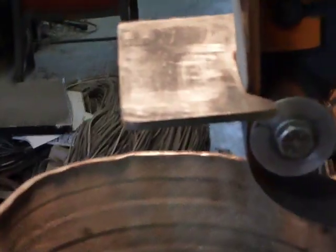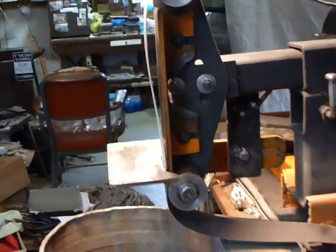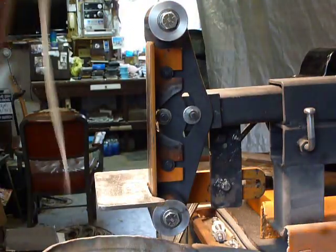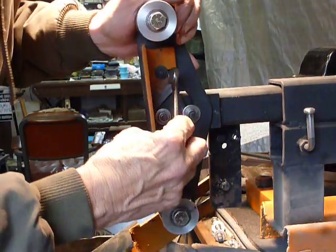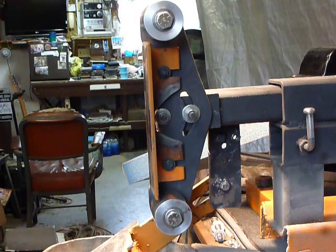I made the platen — it's two piece and it does pivot out to 45 degrees. I'm going to take the belt off and give you a look. The tool rest is homemade and slotted. That's 45 degrees right there; the other way it doesn't quite go 45. You can take the platen off if you want to do slack grinding in the middle.